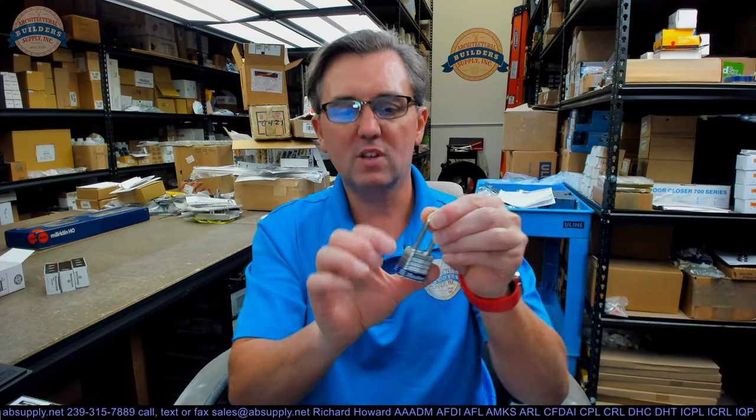Having said that, you'll have lever tumbler locks — a different construction altogether — guarding our safe deposit boxes. A flat steel key with notches works in conjunction with the inner construction of the lock; what's not cut away actually drives the lever tumblers themselves. Lever tumbler is very old technology, definitely predates the pin tumbler cylinder, and is used on highly secure applications. But lever tumbler construction is generally less conducive to the extreme compact design of this type of padlock.